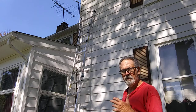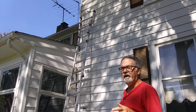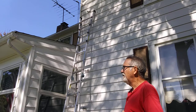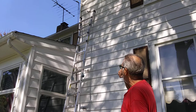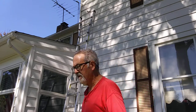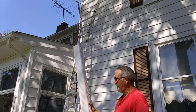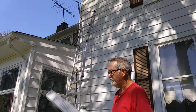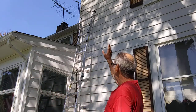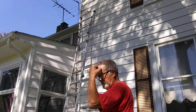Mr. Cool makes a kit to cover the lines, the condensate tube, and the electrical portion, but those kits are like $135 and they only come in 12-foot lengths, and I needed about 16 feet. So I bought a thimble to go inside a gutter to accept a piece of 3x4 steel gutter — that's what my tubes are all going to run in. I got that and a 45-degree elbow that I had to cut a little bit short to get up there, where all the brackets coming down the wall are. That's going to be for the downspout and the tubes run inside that.